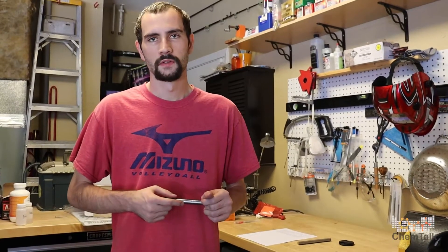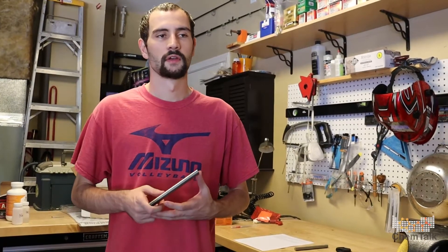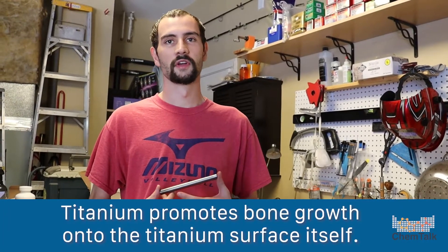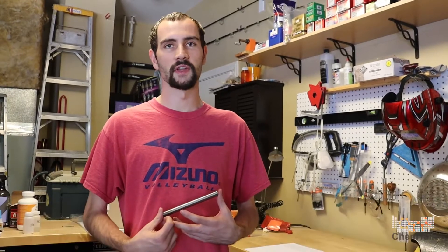My experience with titanium is that titanium dioxide is like the most inert substance known to man. I think only hydrofluoric acid will slowly attack that. Zirconium is right below it in the periodic table — zirconium dioxide is also super inert. I think that's what cubic zirconia is. Speaking to the inertness of titanium, that's why titanium is such a common metal used for surgical implants in the human body. It's very inert and it's actually osseoconductive — titanium actually promotes bone growth onto the titanium surface itself, which is not something any other metal can do.